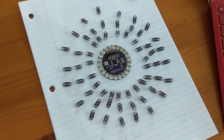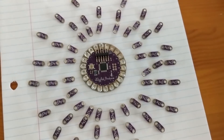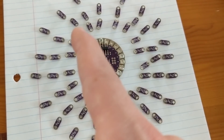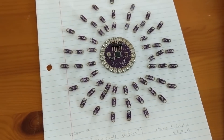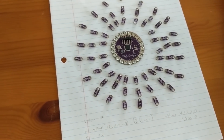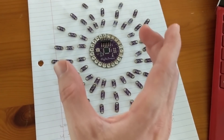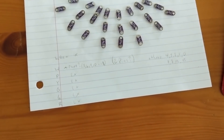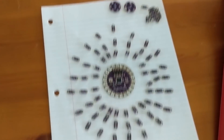Here's the temporary plan: the Arduino goes in the very center, then there's a ring of white around it, then alternating yellow and pink for the next layer, and blue and green on the outside. When the kid pushes a button, the outer ring will flash, then move to the inner one flashing faster, and finally the center one flashing fastest. I figured out which pins to use for each color, confirmed my PWM pins, and verified there's enough power.